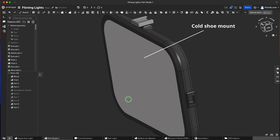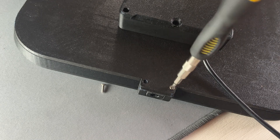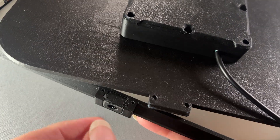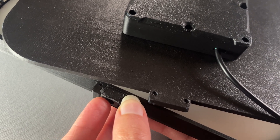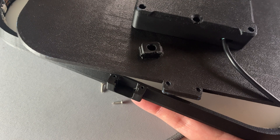After designing it, I got other ideas for different adapters — to mount into other things or mount other things into it. The only downside is that I have to unscrew the back panel to change the adapter, but that's what makes it more secure. Getting the fit just right took a few test prints. I needed it to be secure but not so secure that I couldn't remove it. I ended up scaling it down to 97.5% in the slicer. This tweak is already applied in the published model, which you can find on Maker World — link in the description.